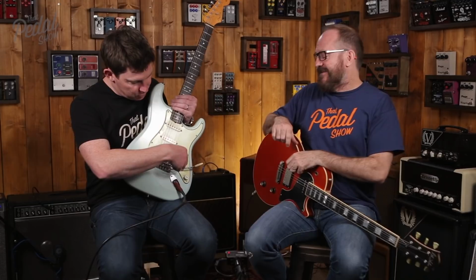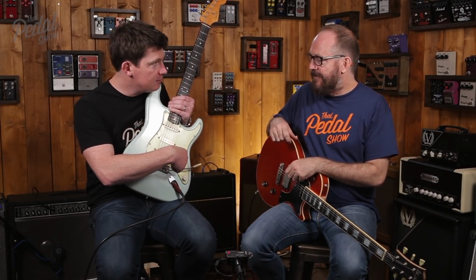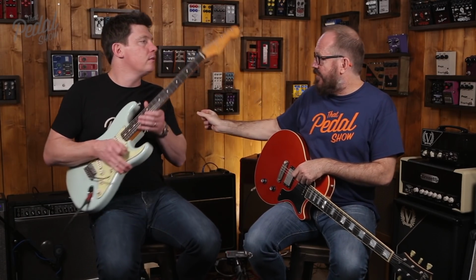That's right. And very good. Because what you're doing there without the mod is treble bleeding. It's basically exactly the same thing as having a bright switch on your amplifier. That bright switch puts a little capacitor across the volume pot on the amplifier, so that when you turn it down, it still retains certain high-end frequencies. It's exactly the same.